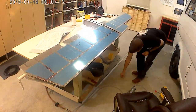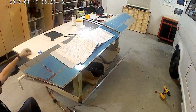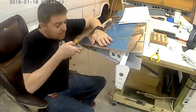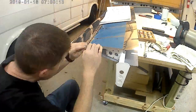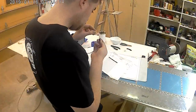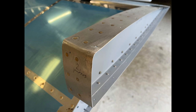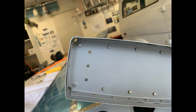I had to drill out two or three rivets in the leading edge there. Right here at the end you're going to see some damage that was done to an elevator — I kind of dropped it, it slid out of my hand maybe a foot or two above the ground. There will be photos. I emailed Vans back and forth and they said pretty much bend it back the best way you can — maybe one sixteenth of filler is going to be needed, probably one thirty-second in all actuality. They said it's a non-event. Those are the photos — God, that hurts. But it'll be easily fixable with filler. Somebody learns from this or enjoys it — more power to them. This was long and drawn out. I'm going to try and start chunking it down to much thinner videos. Anyways, take care, see everybody on the next video.